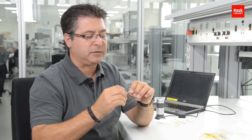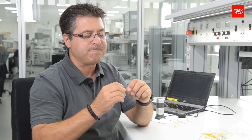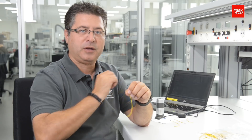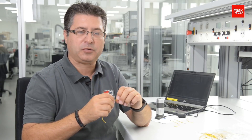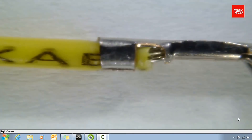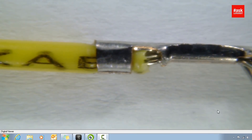First, visual analyzing. Looks a little bit strange. Let me show with the microscope how good it was. Now I introduce the wire to the microscope. Here you can see very well the crimping for the isolation — it was quite very good. Not so deep inside.